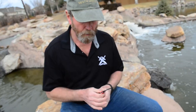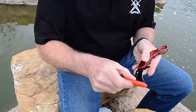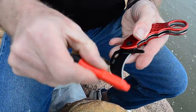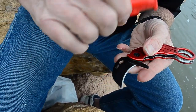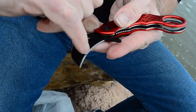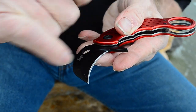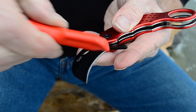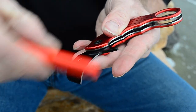So now we're going to sharpen it. We take it like this, slide the sharpener along like this. I see the blade shining more and more. If it shines too much on the cutting edge, you need to tip the sharpener down. If it shines too much on the heel, tip it up a tiny bit. When you see the knife shine parallel all the way across, you know you got the bevel matched perfectly.